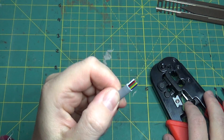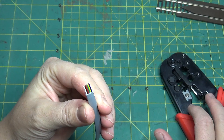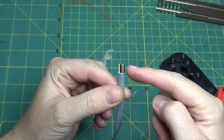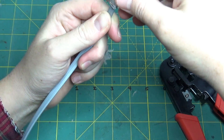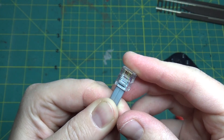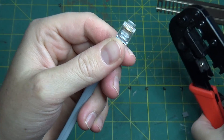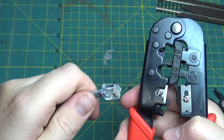Just like that — it's perfect every time. It's so easy to make these with this tool. Then grab one of the connectors. Remember how the Digitrax cable does it: looking up at the connectors, the white wire is on the left and the blue is on the right. I always slide the connector on that same way, then push it on all the way so all the wires go to the end.